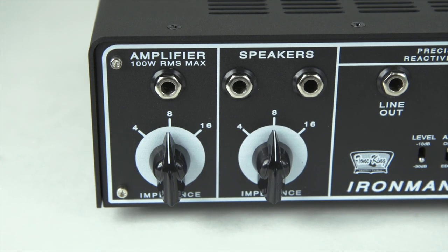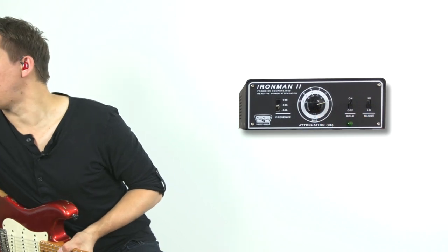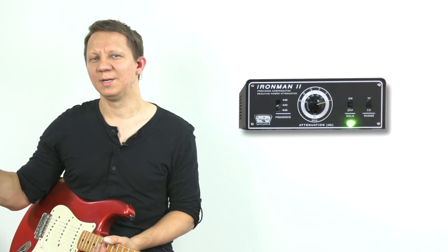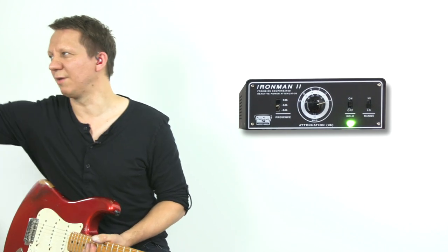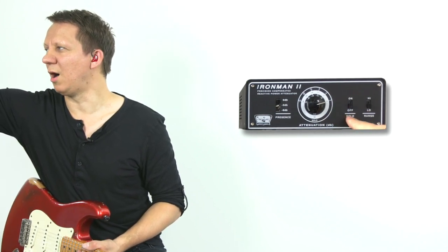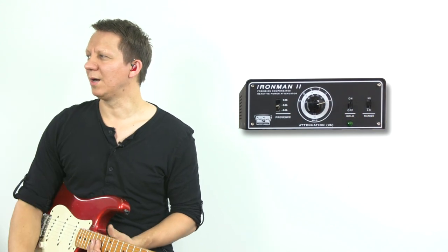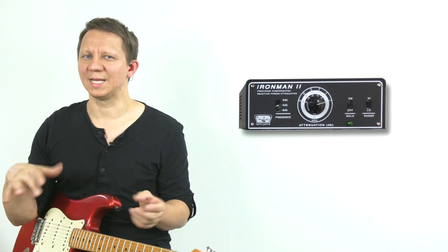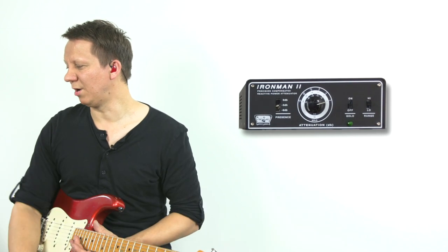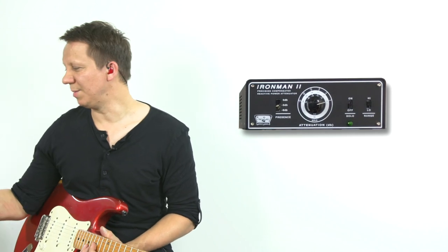And we have to understand, if we're actually in bypass mode, which is zero and the solo is on, we don't want to go into the bypass mode if our amp impedance doesn't match the speaker impedance. We never want to go on the zero here in the solo on. We want to be solo off and in the high position. That way we can mismatch speakers, and the two transformers will adjust to whatever impedance our speaker and whatever our amp is set to. So amp has to correspond to the dial of the impedance knob here.